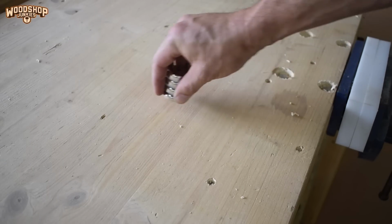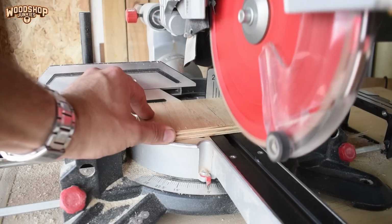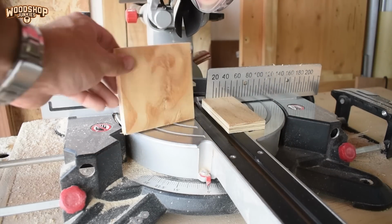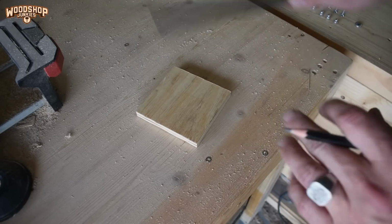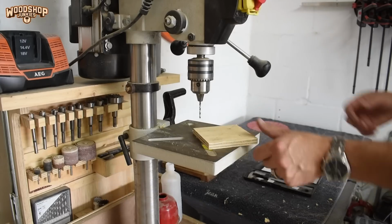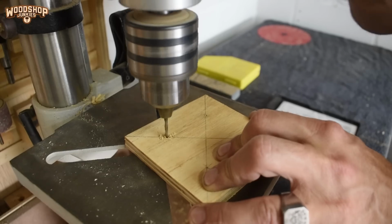And to increase the effective working surface of my magnetic floor sweep, I'm going to be using 4 magnets spaced evenly. To make it easier to handle the magnets, I'm going to embed them into a square piece of 1/2 inch or 12mm plywood.